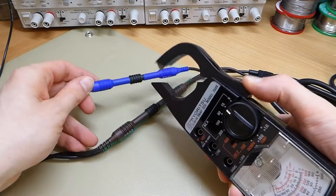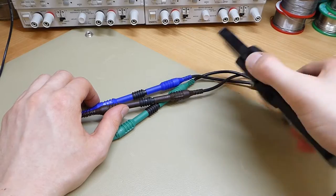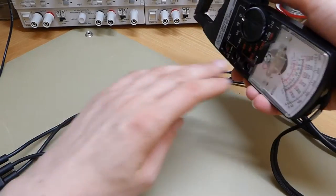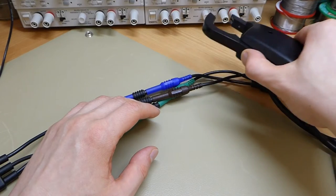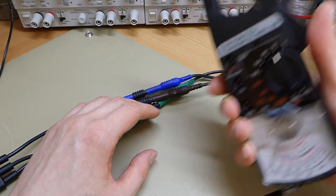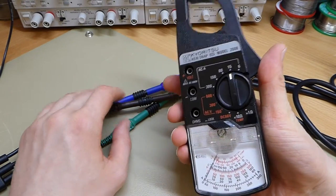normally you don't have cables as easily accessible as this one here. You might be working on some installation where you need to, you know, get around a really thick wire somewhere and you can't actually see the meter or the display on a digital one. So what you want is to be able to clamp your meter around the wire and then push a hold button or something that then keeps the reading on the meter until you reset that.